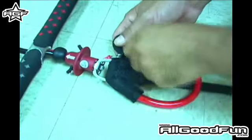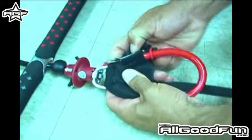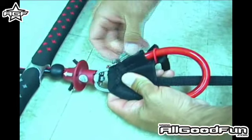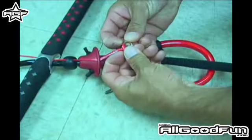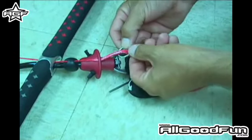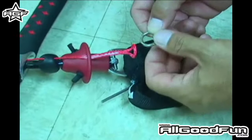Pull the Velcro open on the IDS landing line quick release handle, otherwise known as QR2. This will release the landing line ring from the security pin. Once the ring is off the pin, go ahead and remove the stainless steel ring from the landing line.